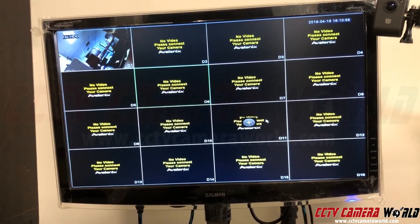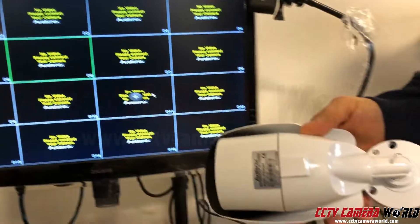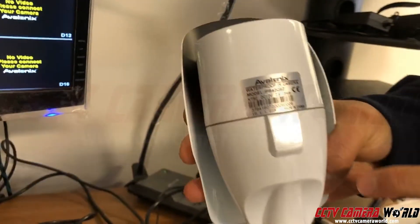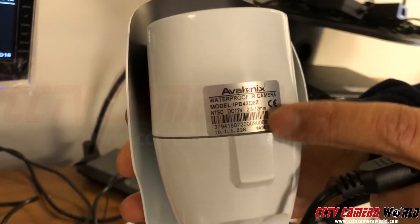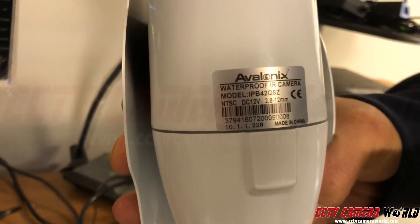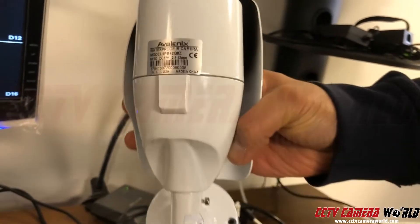In this video we're going to show you how to use a Pro Series camera on our PoE NVRs. On the bottom of the camera serial number, it actually has an IP address here — 10.1.1.something. That is the IP address these cameras come pre-configured to, so you can connect them directly to the PoE ports in the back of your NVR.